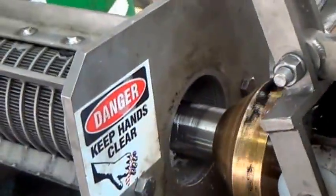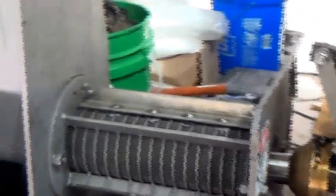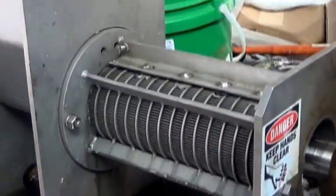Next we're going to run the filter media from some oil filters. Given that this is a small press — about two inches in diameter on the shaft, four inch diameter — larger pieces like these gaskets that we found in there would get stuck in a press this small, so we're going to hand sort them. They could be screened out for a small press application, or in a bigger six-inch press they'd go through.